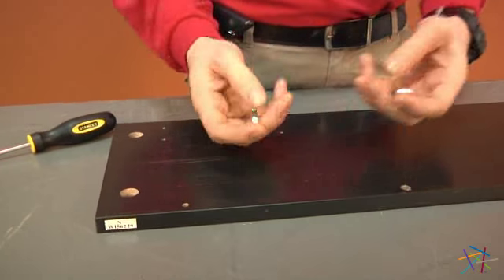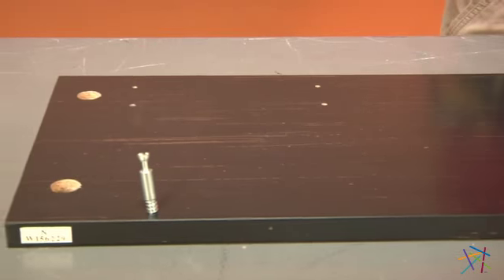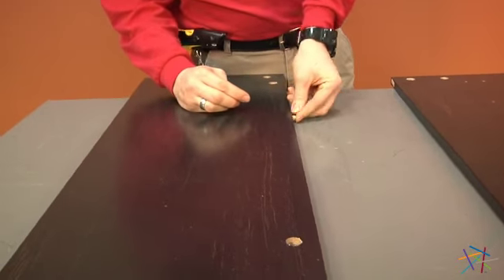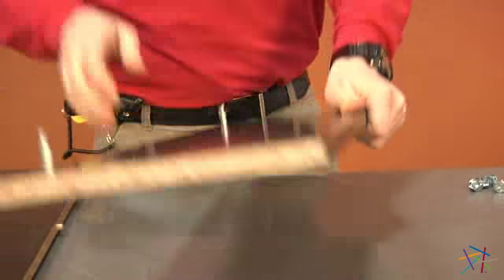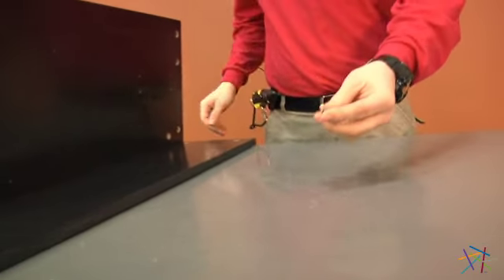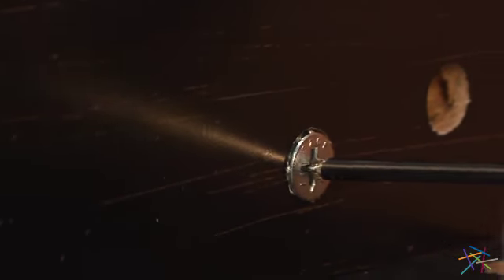Take four of your pins and with two of your panels labeled N, into each of the threaded holes, using your phillips head screwdriver, tighten into place. Now using four of your dowel rods, insert two in each of the unfinished sides of your panels N, then take your pieces N and insert the dowel rods into the holes like so. Use your cam locks in each of the holes and turn to the right using your phillips head screwdriver to tighten. Repeat this step for your second piece M and N.